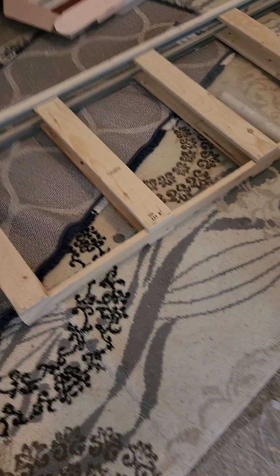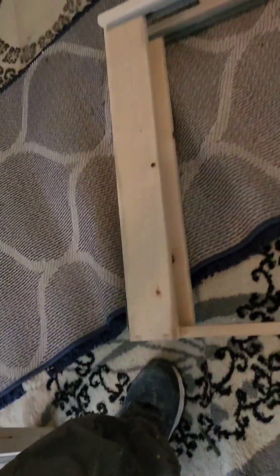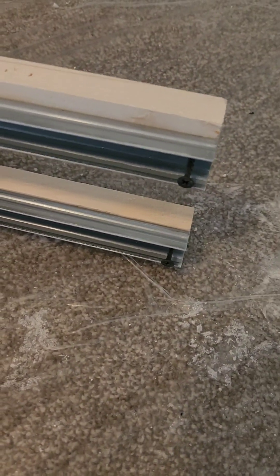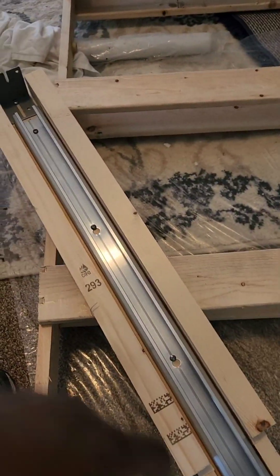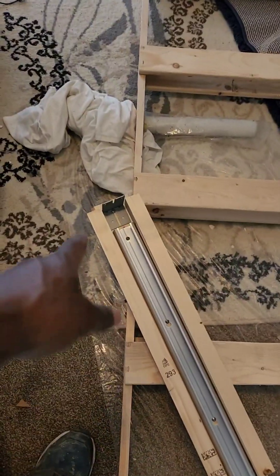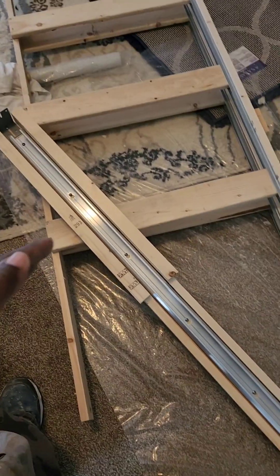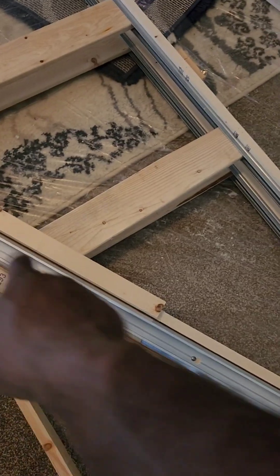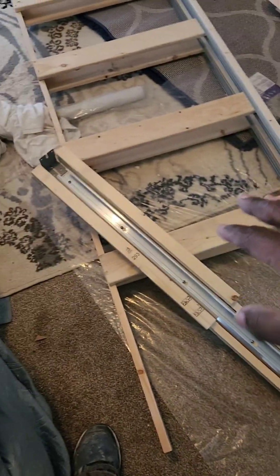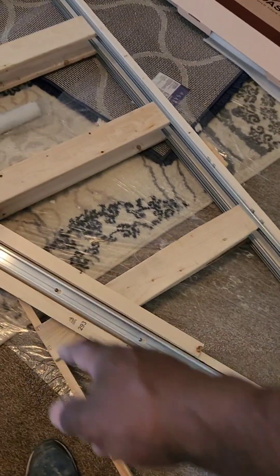This is the frame — this is the bottom, this is the top. On this kit the top is open, just waiting for the frame rail. If you look closely you'll see two screws. Now the rail — one side has these double pieces of one-by and also a mounting piece. That side is going to be your opening side, so the door will go into the pocket and into the wall on that side. When it comes out it's on that side. I think they put the extra pieces there to make sure the door doesn't flop around.